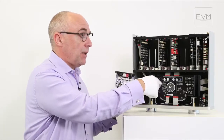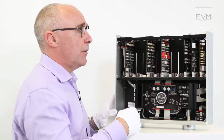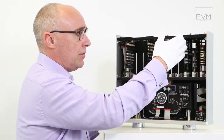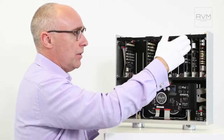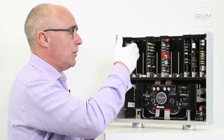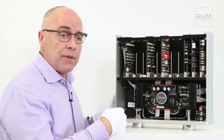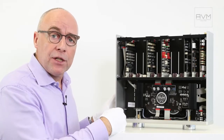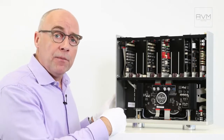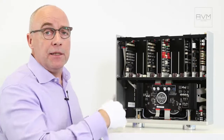Actually, also the high voltages and all the other voltages used to operate the tube output module are generated in this special power supply. In this open unit, you can very nicely and very well see that the signal path, where the signal comes into the input modules on this side, is transferred via the backplane to its output sections. On no place is there a cable in the signal path. So actually we have no uncertainties or no fluctuations from piece to piece, because there are no cables in the entire signal path in the unit.